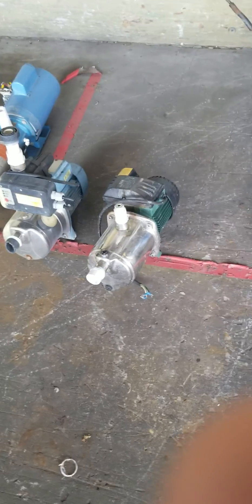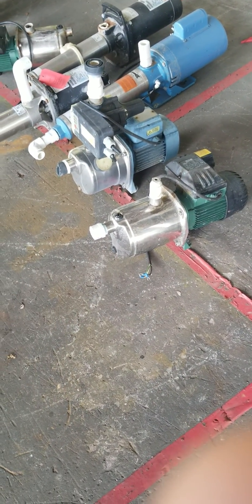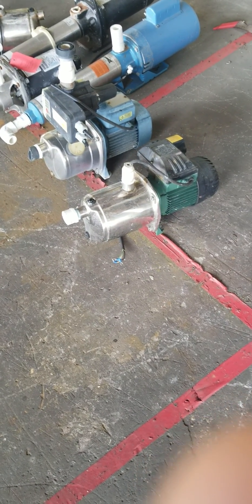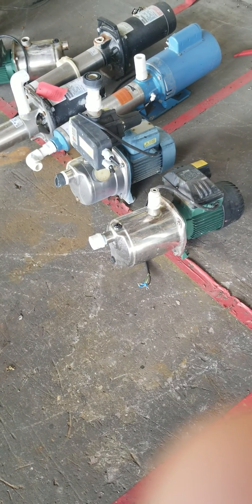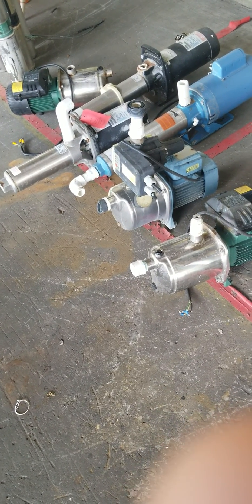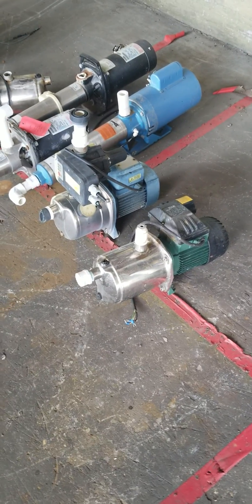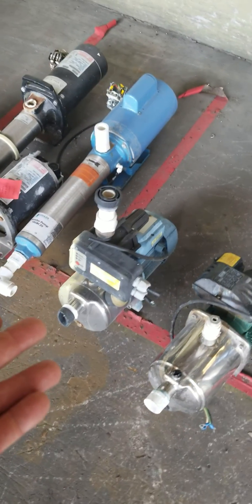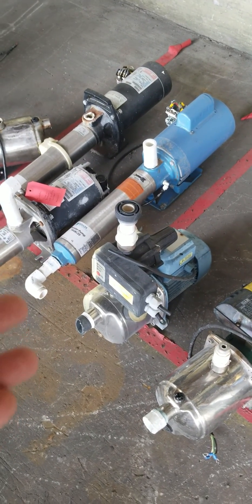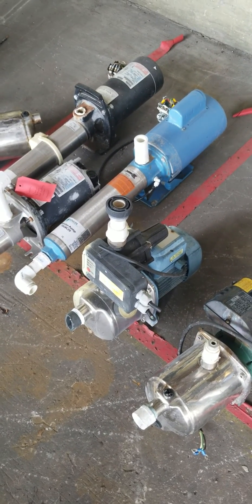Some of the pumps look like this — a decent pump that works but only builds about 100 psi and only does about five gallons a minute. So at most you're making five gallons a minute, meaning if you're making one gallon of good water you're wasting four gallons of bad water. A lot of companies are cutting corners and going cheap on the pump, giving you less quality water and fewer gallons per minute.